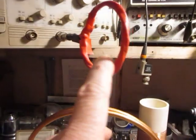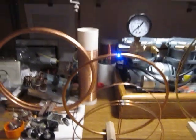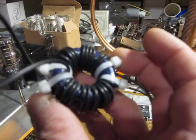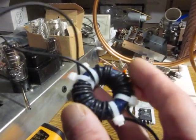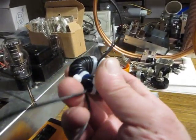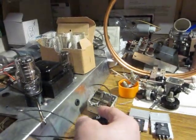So there are a couple of sweet spots when it comes to tuning. I am sensing with that 2-turn coil plugged into a scope. So anyway, that's the choke which I had before. It's a ferrite choke with 2 windings of 10 turns, and it was connected to the power supply coming to the circuit before. One side was on the positive rail, one on the negative rail, on a common core.